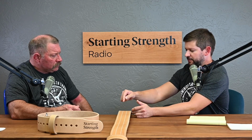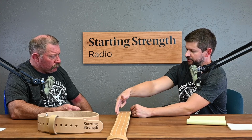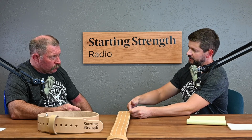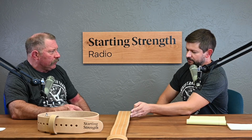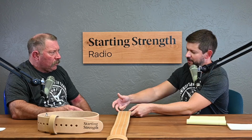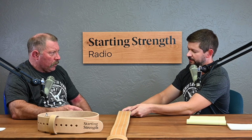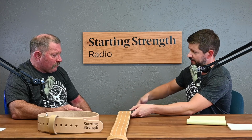But it still remains perfectly straight. How did you do that? Usually it's off just in one direction. A lot of times one strap is just ever so slightly thicker than the other one. So when you're gluing it together, you want to align one side perfectly and leave all your mismatch on the other side, so you only have to correct the unevenness on one side. Then you may have a little rough edge where some glue squeezed out. Plus you want it to look the same, so you just sand the other side too.